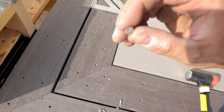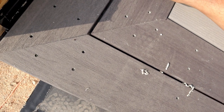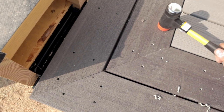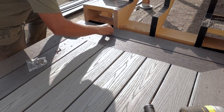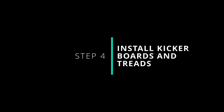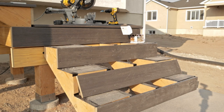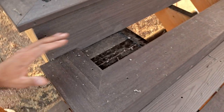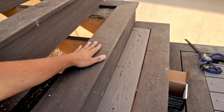Then you take your plugs — you can see there's a grain on them. Make sure when you put these in that you're lining up the grain, as it helps hide them better when the grain aligns in the same direction. Just take a little rubber mallet to tap them in. Next I install my kicker boards. As luck would have it my rise was the exact width of these boards so I had no trimming to do. Once the kicker boards were installed I moved to installing the treads. I cut in my 45-degree angles, put each side in, and then measured corner to corner to get the distance of the middle board.